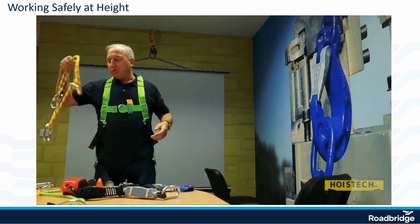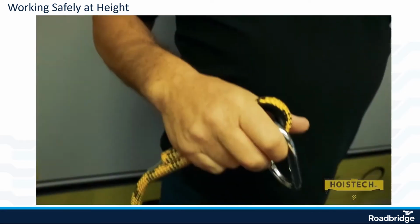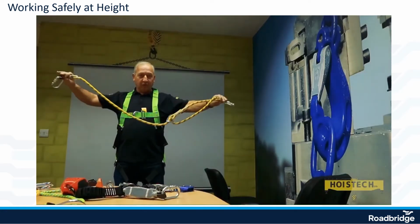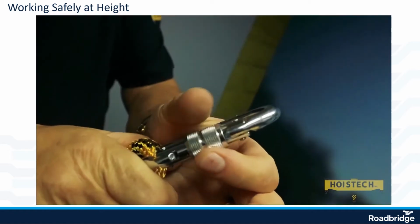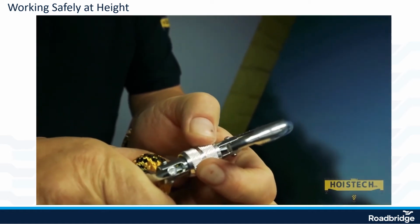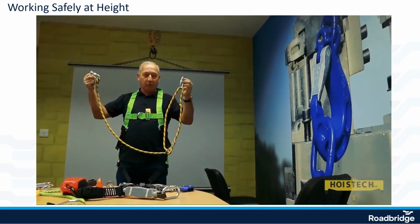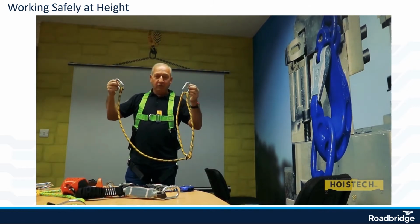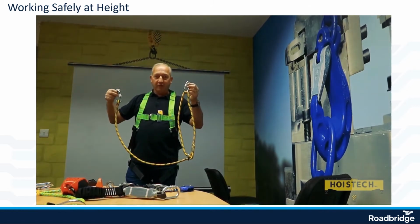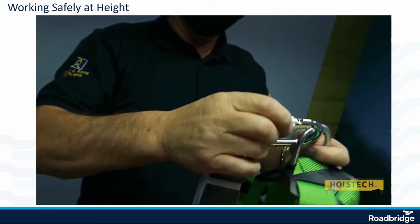When working at height, we normally have two types of lanyards which we use in conjunction with our safety harness. This will be restraint, which would normally be used with an MEWP, or to restrain you from getting to a point where you could fall when working at heights. Normally found when used in an MEWP to restrain you from climbing out of the cage.